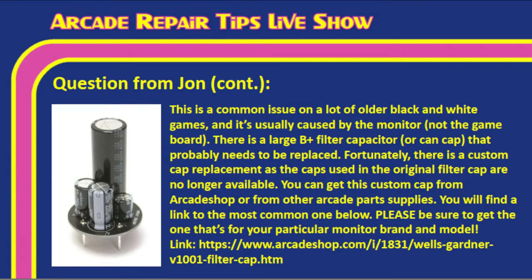Okay, so if you don't have a 1001, you have a different one, there are some can caps available for those as well. But the key here is the B-plus voltage, making sure that the B-plus voltage is correct. And so you can tell if you need this by whether or not the voltage is reading what it's supposed to read. If your voltage is not reading that, then obviously there's probably an issue with this can cap or something else in the high voltage section of the monitor.